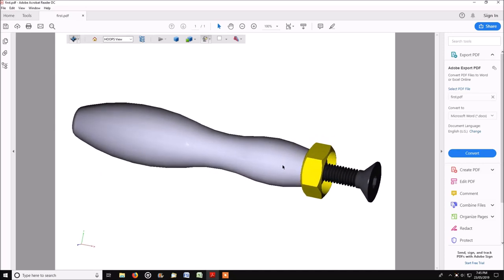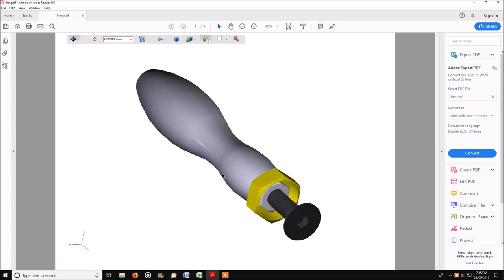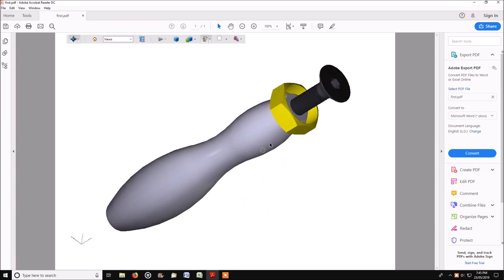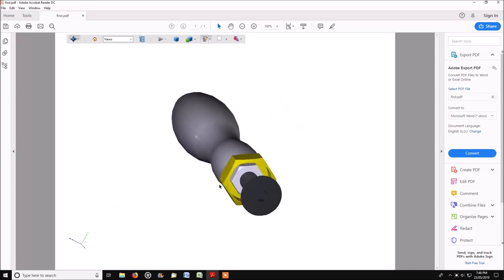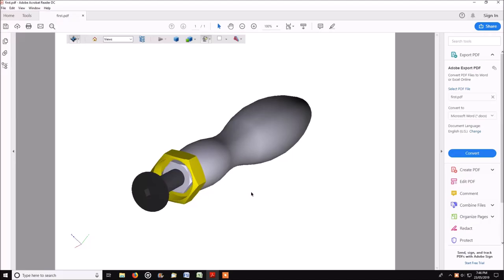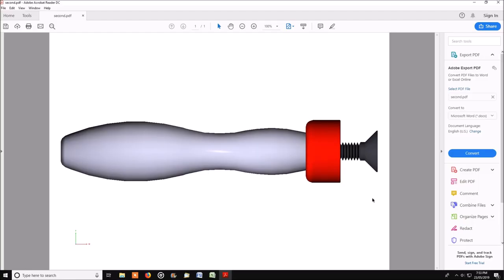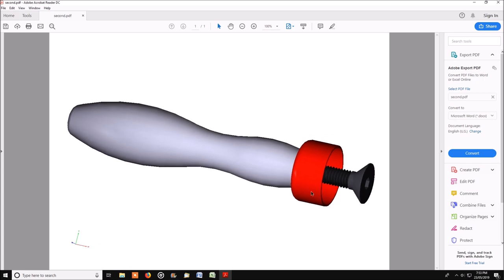G'day. When this was first suggested, I wondered whether an opener could be made using a lathe. I had no idea, so I put a few designs together. This being the first one, and it sort of worked, but the bore was not big enough to get enough grip on a number of teeth on the seal, so I redrew it with a larger bore.